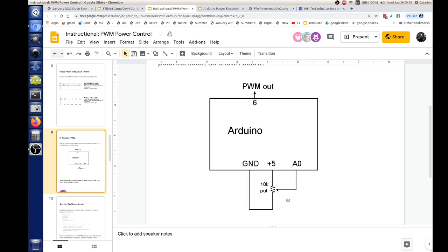Last night we built the strip board Arduino and got that working. Yeah, it's amazing. Did you use the Fritzing design I sent you, or another? I saw that it was an LED and the button added. Yeah, we took that. Most of it was good. We changed a couple of things because we had to add the USB to serial converter. Now that we understand where the pins go, we put some components in the most convenient location, so we changed some stuff around.